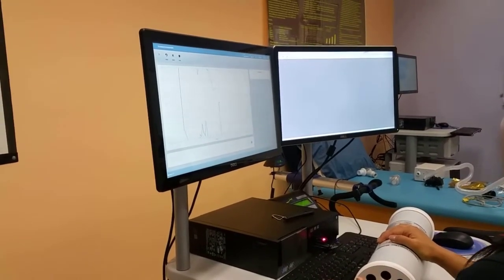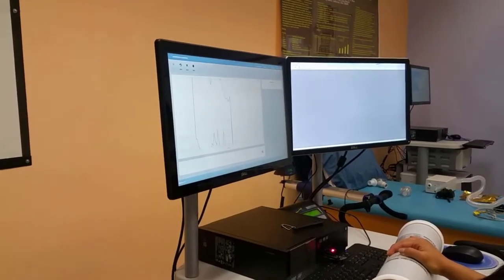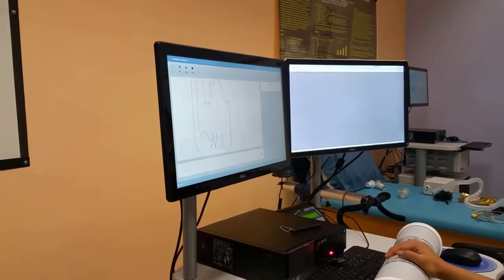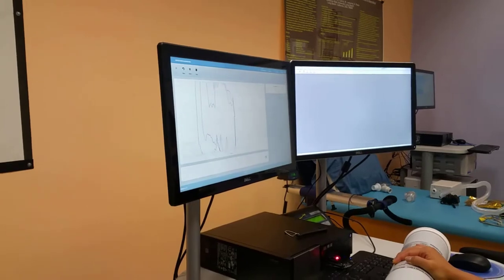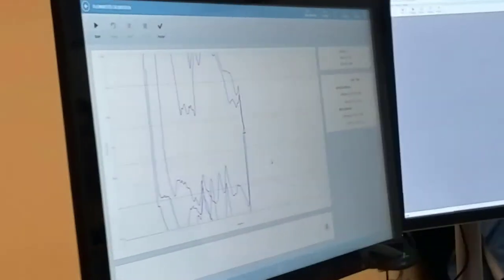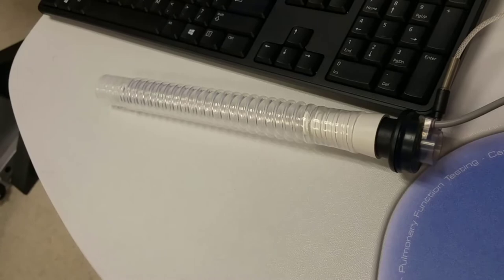So this one, you see the scaling's way different because the level of flow is so much smaller. Even though it doesn't really matter what speed you plunge it, people will typically plunge it a little bit slower. This one only wants two full respiratory cycles. And you have a 0.03% error, so you're pretty close, but not right on. So you're good. The calibration passed. It would pop up in red, like I said before. You can just click accept. You're ready for a test now.